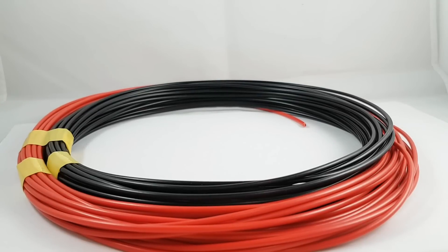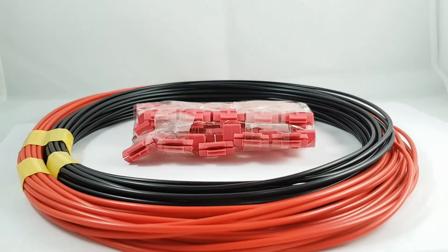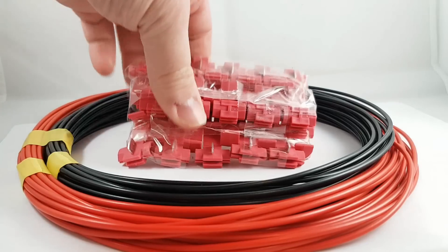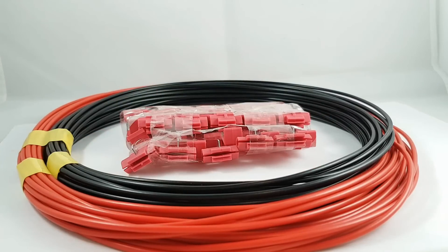If you imagine you've got your controller, which then goes to these two bus wires, from the bus wires you will need to connect them to droppers from the track. The droppers I use are these splice connectors, which I'll show you more of later. You can get loads of these for a couple of pounds on eBay or wherever, and they literally splice into the bus wire while connecting to your droppers without the use of a soldering iron.